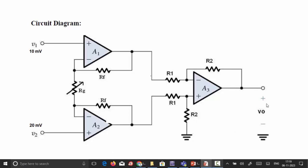For example, with a gain of 5, the differential input is the difference of the two input voltages, which is around 10 millivolts. Based on the gain of 5, we calculate the variable resistance value accordingly. The theoretical output voltage is gain multiplied by the differential input voltage: 10 millivolts × 5 = 50 millivolts obtained at the output of the instrumentation amplifier.